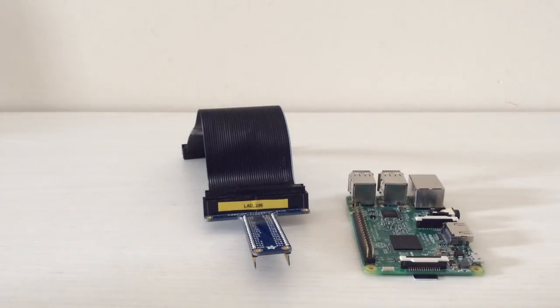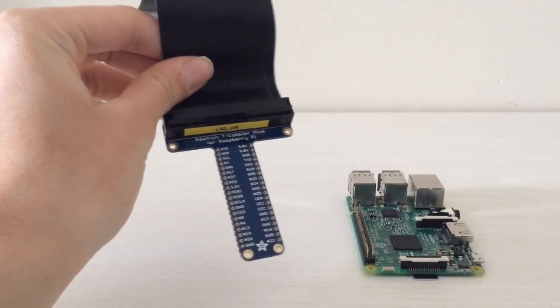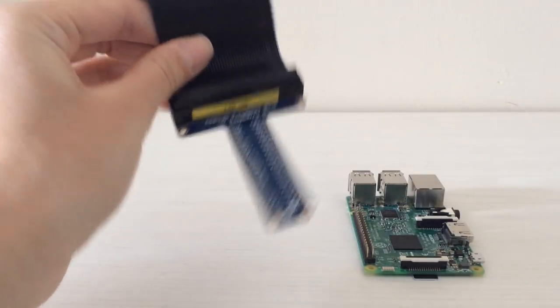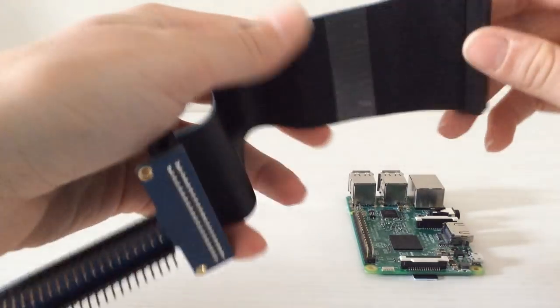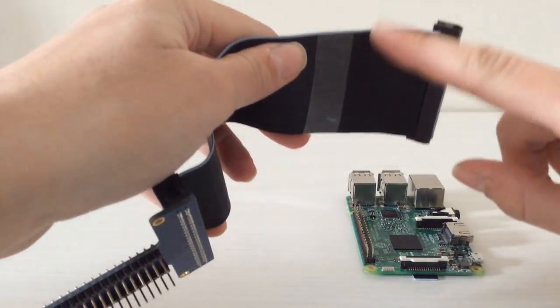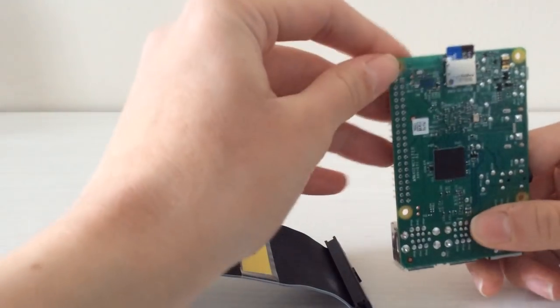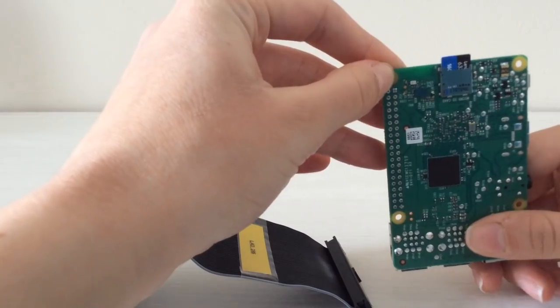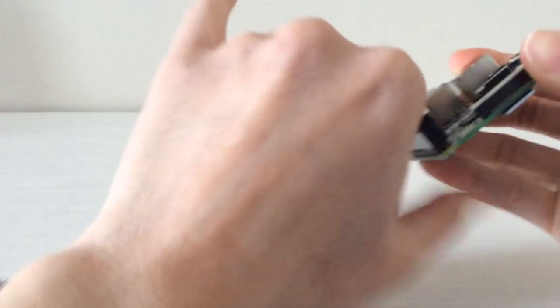To work with the Raspberry Pi GPIO you can use a GPIO adapter — in this way you are able to read the name of the pins. You have to be careful when connecting the adapter to the board: the side where there is the lighter wire has to be connected to the side where there is the square on the board.